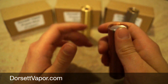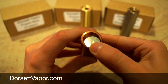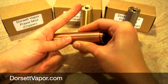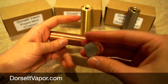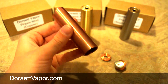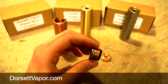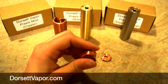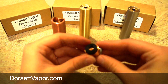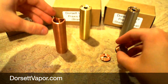This is how you take your button out — it is really tricky and takes some getting used to. It's very unique but works out perfectly. You push it to the side, push in, and you can use a finger to pop it right out. There are no threads — just a groove where the button was. Inside are two springs pushing the button out, and inside the base of the button is a custom-made stiff spring. There's a pin that is welded into the bottom of the brass locking mechanism, so it's not going anywhere.